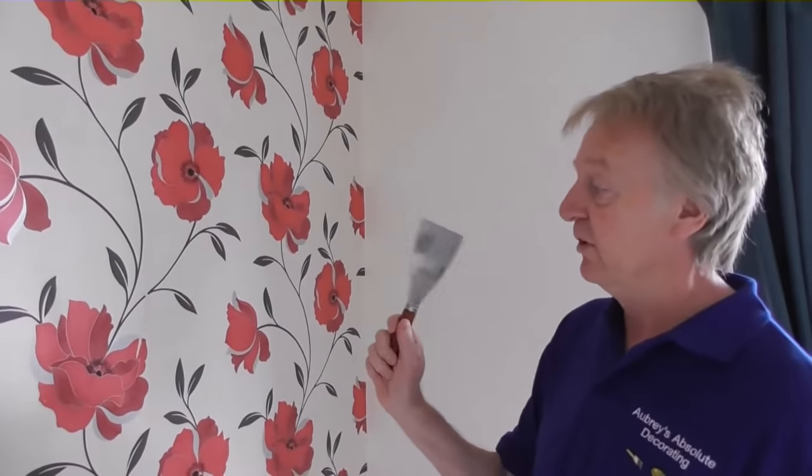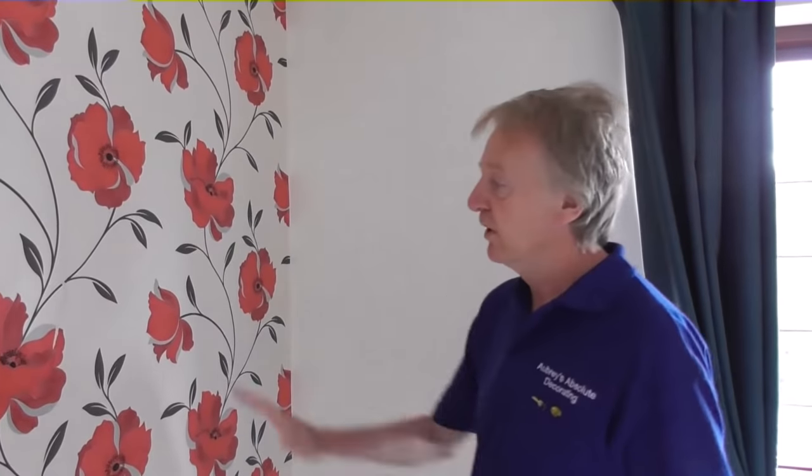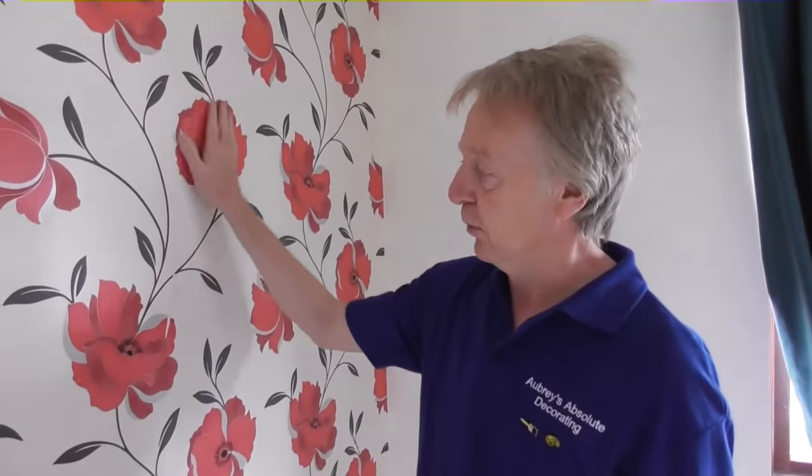So I'm going to have to use the traditional method to strip this off. Most of these modern papers have got a coating on them to make them washable, scrubbable, or spongeable, so that you can keep them a bit clean. So if you put water straight on top of that to strip it, it'll just run straight off. We need something to score up the paper to let the water get underneath to soften up the paste.